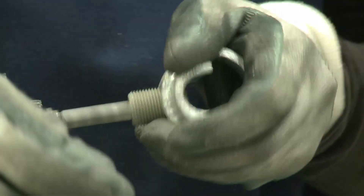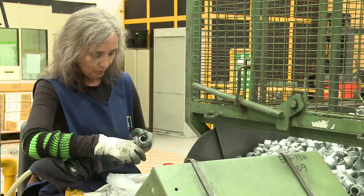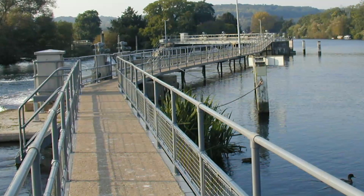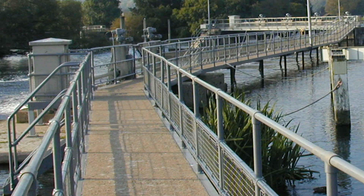The average life of a structure using corrosion-resistant hot-dip galvanized key clamp fittings will be 37 years in a category three town such as Newcastle upon Tyne. This compares very favorably to the 4.7 year lifespan of a fabricated untreated steel structure. Key clamp fittings do away with the need for any bending or welding of tube on site — it simply needs to be cut to size. This dramatically reduces labour costs, resulting in added long-term value to the client.